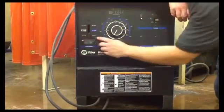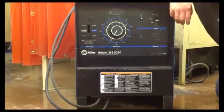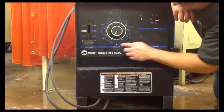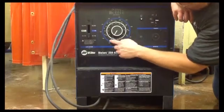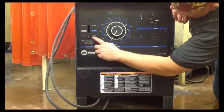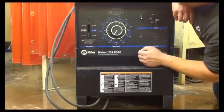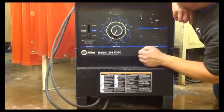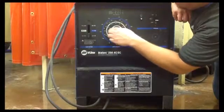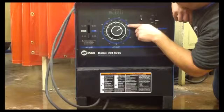If you move your lever down and go 35 to 155, it's still going to be the same thing. You're looking for either 120 amps or 90 amps, but now you're looking at the inside numbers on the blue circle, which is right here — 35 to 155. That's your range. If you're going to do 7018, 1/8 inch rod, you're going to go around the scale until you find 120 amps, which is right here on the inside of the blue circle.